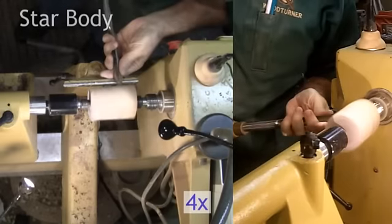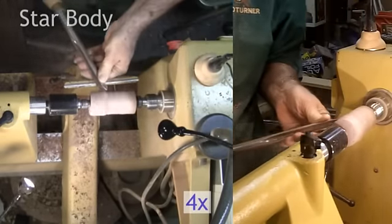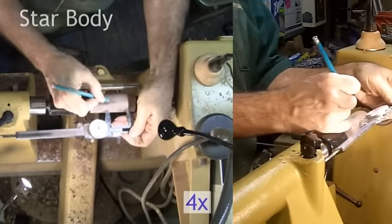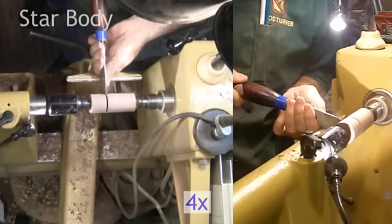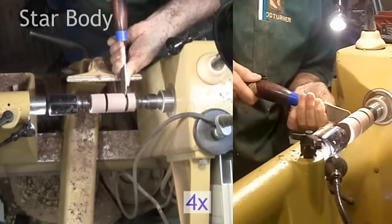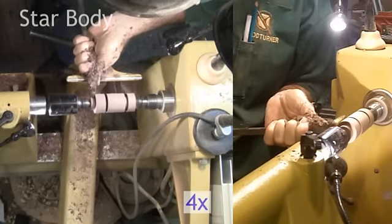First order of business is to, of course, give the wood a couple of spins to make sure it doesn't run into anything as you start turning and jump off the lathe. This piece of walnut is a little bit difficult. It's a product of urban forestry. It's not well dried, but it is dry. It has a lot of checks and wind shakes, and so it splinters very easily depending on where it hits.